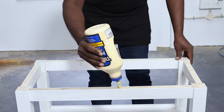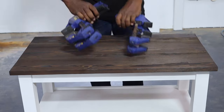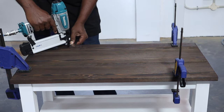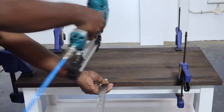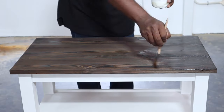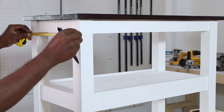Now that the paint had dried, we fixed the top panel to the frame. We centered it carefully after measuring with tape and used wood glue to fix the table top to the frame, then used our quick grip clamps to hold the panel. After placing the panel, we nailed the table top to the frame to hold it in place until the glue fully cured. We then applied two coats of Varathane water-based polyurethane on the top to seal it — sand lightly after the first coat using 320 grit sandpaper for a really smooth finish. Make sure to use caster wheels with a locking mechanism to prevent the cart from rolling.